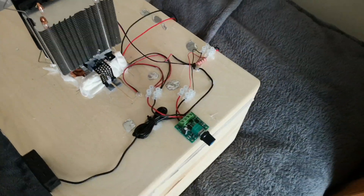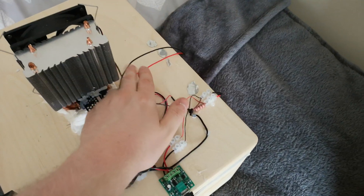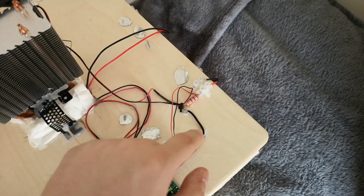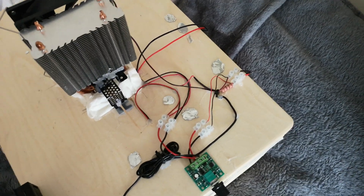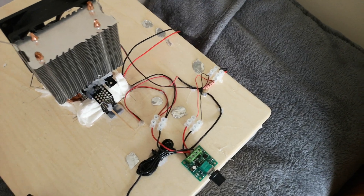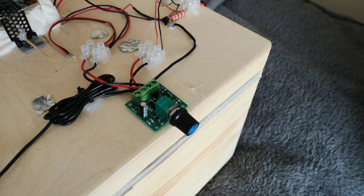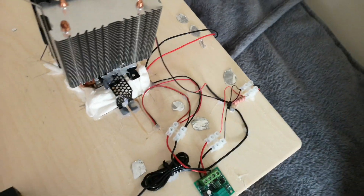The wiring isn't too crazy. There's a temperature sensor up here — it's reading 22 degrees, which is about the temperature in my room. Those two wires go to the Peltier itself. Power comes in here, and there's a resistor that goes up to the top fan — it slows it down by about 15 to 20%. There's also a fan controller potentiometer that controls the interior cold side fan as well as the fan on the bottom of the box, set to about 50 to 60% at present. The temperature sensor wire feeds through a hole there — and that's about it.